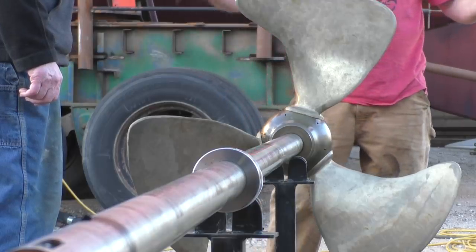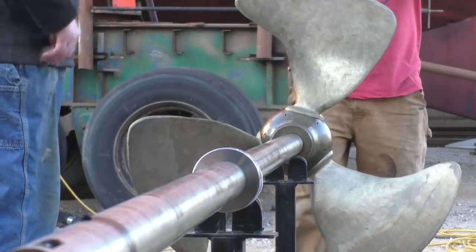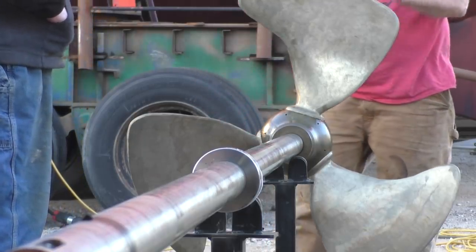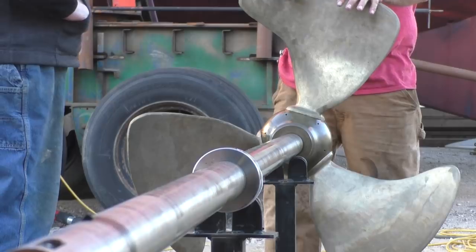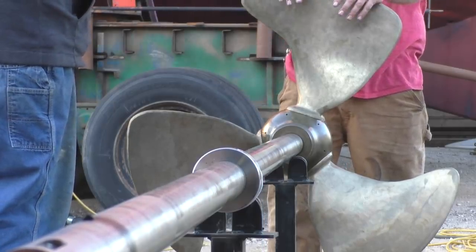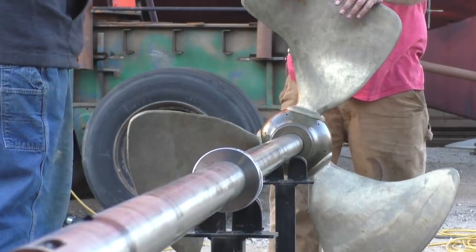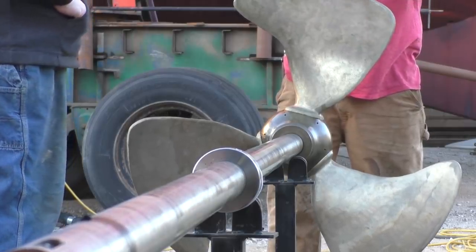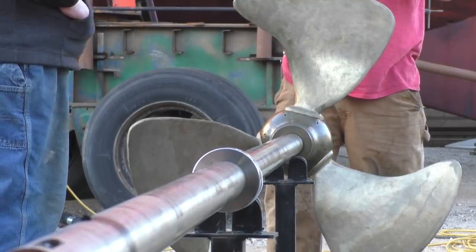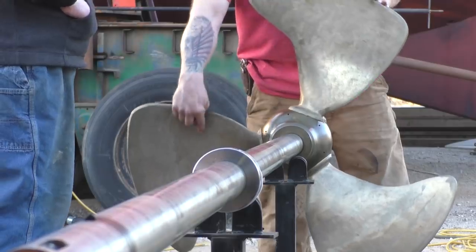And to me, when you spin it, if the weight's out here on the end and all this weight's in here close, that's going to throw it off. This has more pull force, right? Because the weight's further out. Force is higher. Yeah. The centrifugal force would mess it up. Right. So I don't just need to get them in the right weight. If I was going to get them better, I need to get them with the center of gravity in the same spot.